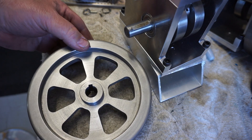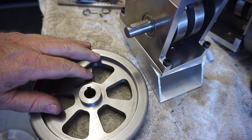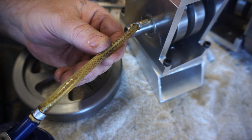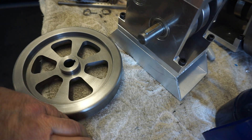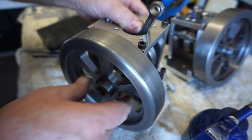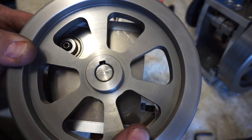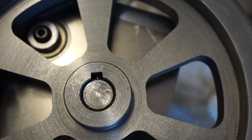And we're done. There's my broach keyway in the flywheel. I've got the key fitted — it's a 5x5mm bit of key steel. I've done the calculations and I should have about 0.1mm clearance here, which is pretty close to what the black book specifies. I'll put a little bit of oil on this before I assemble it. Hopefully that should slide on — beautiful. I don't want to push it too hard just yet because I've got to work with the camshaft. Flywheel's on now and you can see it's a very snug fit.